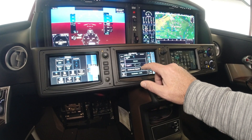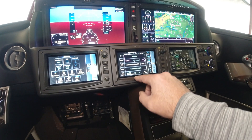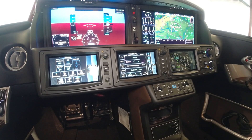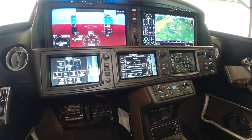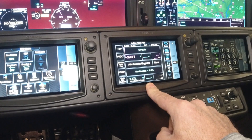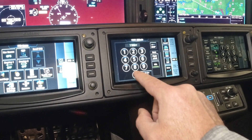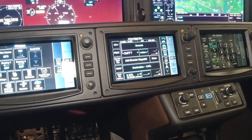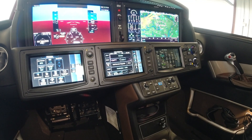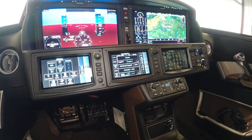An intermediate waypoint is going to be the Swift Intersection. Say, for instance, we're flying along at 19,000 feet or Flight Level 190, and ATC says '379 Juliet Mike, cross the Swift Intersection at 11,000.' We just enter 11,000 feet here. That gives us a crossing restriction, and our avionics system will give us a calculated descent rate and tell us when we need to start the descent to cross Swift at 11,000 feet.